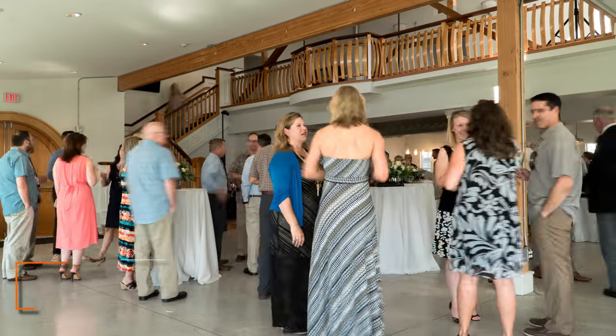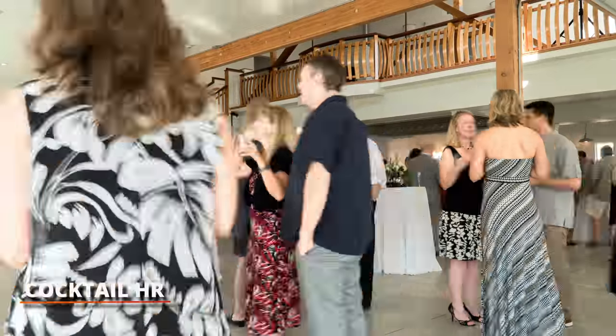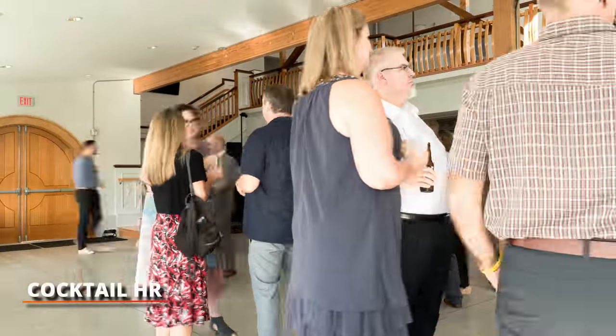It's very important when you have a very large room to have proper zoning of speakers. A lot of times the room is very long or very wide, or you have a ton of guests. What we need to do is set up the right amount of speakers so everybody can hear what's being said, and it's a pleasant experience for everybody. Because if we turn up the speakers to reach the people in the back of the room, the people in the front are going to get blown out — it's really loud, and you usually see those people covering their ears.